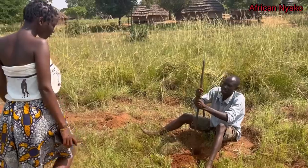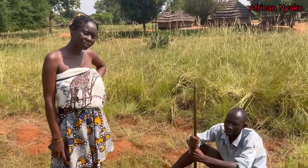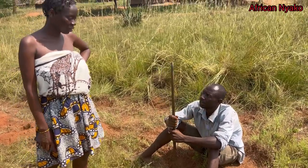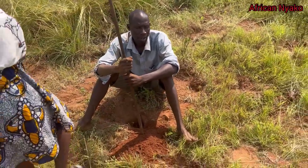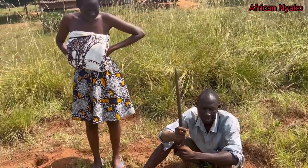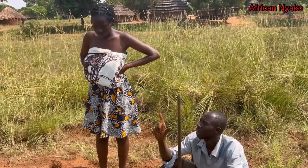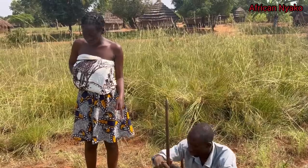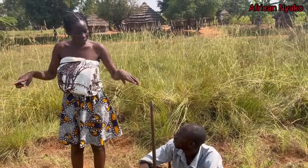Samuel, how are you? I'm okay. So you're going to tell us, how long have you been building houses here in the village? So many, like 15 years. 15 years. Wow. So you have experience, right? Enough experience. So what do you need to set up this grass-thatched house? First of all, you need to dig this hole. And then secondly, you bring poles. This pole, this shape, you put around 20 in these holes. So are these 20 holes? There'll be 20 holes. So do the holes determine how big the hut will be?